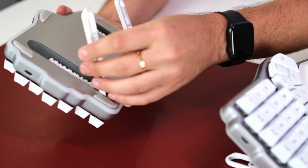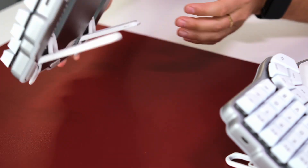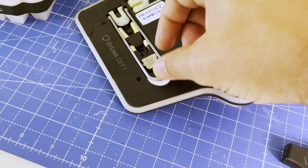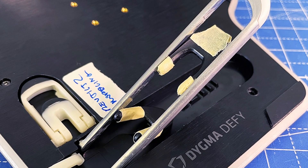For the tenting legs, it's paramount that they're extremely sturdy and that the experience of unfolding them feels like opening the lid of a MacBook. But in our sample, moving the legs and rods felt too light and flimsy. So we changed the hinge mechanism on the base and added a small silicone piece so the leg gets tucked into position when folded. Plus, we're making millimetric adjustments to the size of the rods — that's why you see a bit of tape on them; it's for the tests.